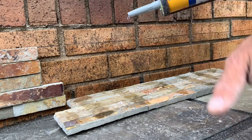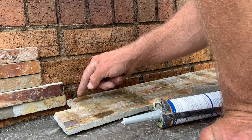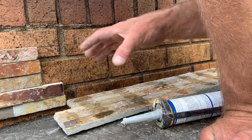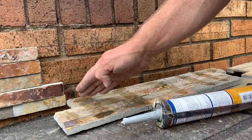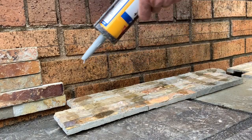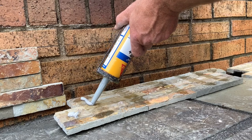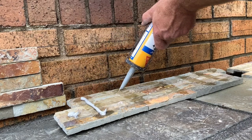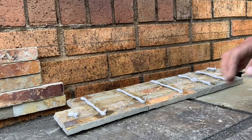Get the mastic. So when I'm gluing the mastic, I won't take it right to the end - I'll bring it in about a centimetre from each end. Because when you squash it to the wall, the sealant will spread a little bit. So never go right to the end. That gives us seven points of contact.